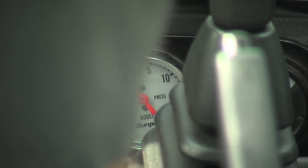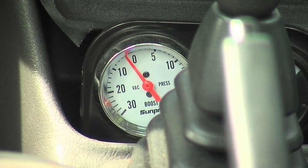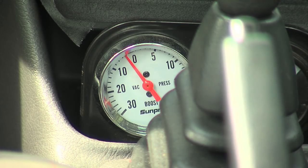The vacuum gauge really isn't needed, but it's nice to have — it's good for peace of mind, so you know everything's working properly. I did have one instance last winter where the vacuum switch sort of froze, but it froze in the on position, so it stayed on all the time. Not really a big deal other than it being a little noisy. But it is set up so that should it fail, it fails in the on position.